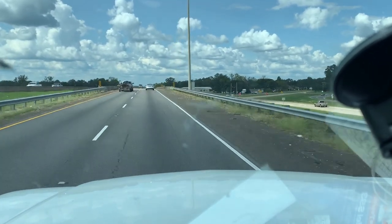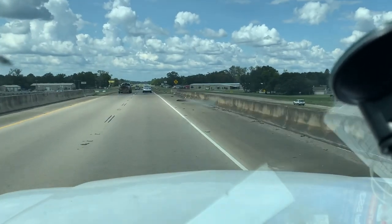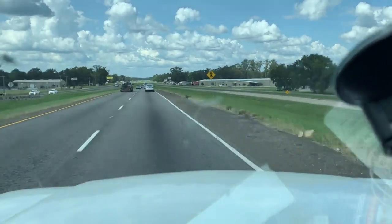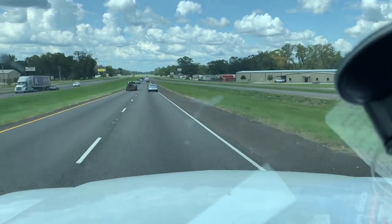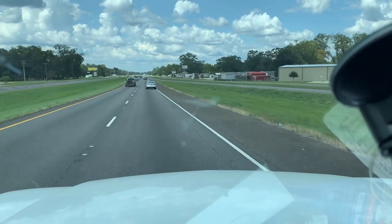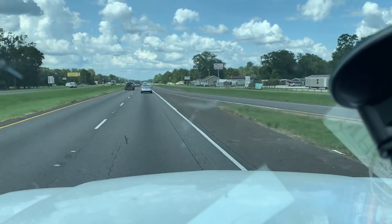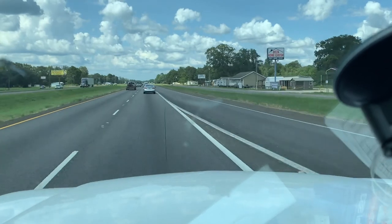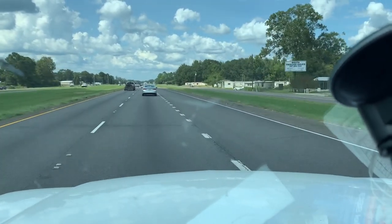Mobile home, basic 14 SEER. I catch a lot of heat for this, so we're going to go ahead and clear this up right now. I am headed over there. I'm going to take the TXV out, and I'm going to put a piston. For all you guys out there that say, oh man, you took a TXV out and put a piston, you just ruined the efficiency of that unit, and you voided the warranty.